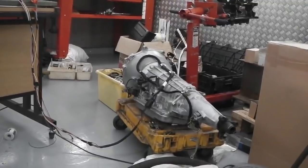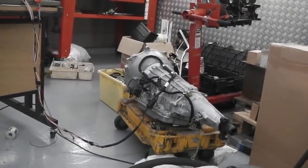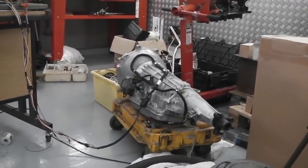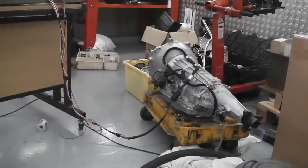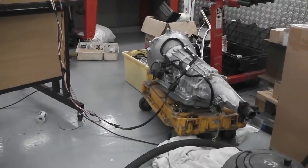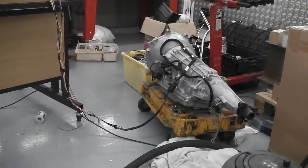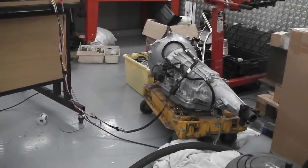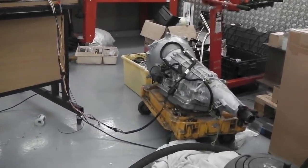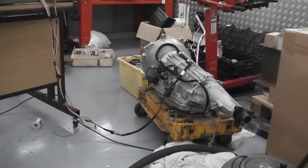Then once the loading on the engine becomes more evened out and you're coasting or you're cruising again, it would then re-engage the lockup converter. So when engine conditions and drivetrain are very harmonious, it looks like that's the time to activate the lockup. For that reason, we'd need to know when the engine was under load, and you can get a basic adjustable vacuum switch which would fit on one of the vac lines.